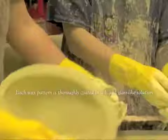That posture. Yeah. Tip it upside down so it'll drip off, and then use your brush to get all the excess off the cup. Okay. Extremely carefully. Yeah. With both hands, dip it in the sand, and you cover the whole thing. You can get it down in there a little bit. There you go.